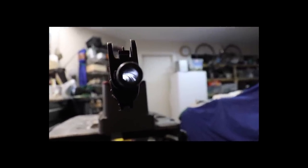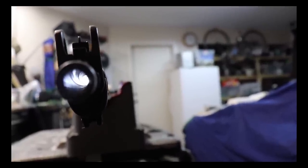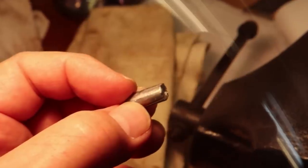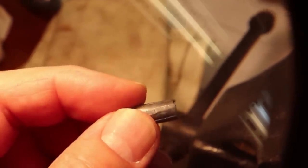Here's a shot up the barrel — it's the best I can do, and you can see the rifling is pretty clean. To be a bit more rigorous, I drove a lead plug through the barrel to get an imprint of the rifling, and it's clearly still pretty solid. It measured about four thou compared to five when it was new, and four thou is more than enough to maintain the rifle's accuracy.